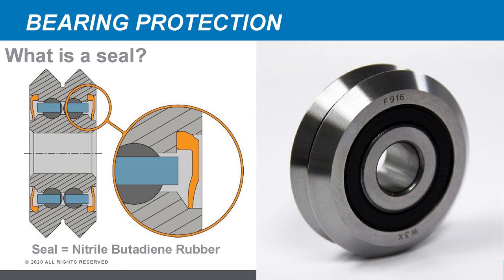Let's look at the different types of bearing protection. A seal is made out of NBR rubber — nitrile butadiene rubber — mounted into a groove on the outer race of the bearing, where it lightly touches the inner race. This is great for keeping small particles outside the wheel and keeping grease inside. The slight contact adds a little more friction and rolling resistance. This is also the lowest cost solution for bearing protection, works very well, and is commonly adopted on many bearings.